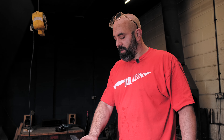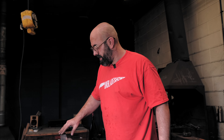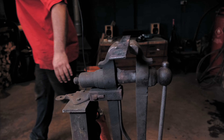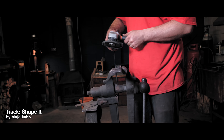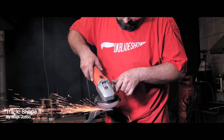Essentially you just want to whip the scale off both sides, then we'll chop it up, re-stack it, fire-weld it up again, leave a little bit of time to soak to make sure the welds are set, and then chop it down the middle. I'm actually going to tack all the way down the sides as well to make sure nothing splits, because that material dragging just wants to open up all the welds down the side, which will ruin what I need to do.